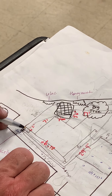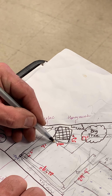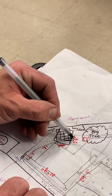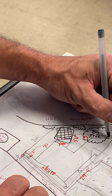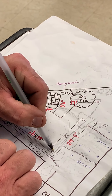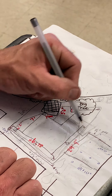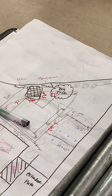Basically it just looks like you'll have one 3/4-inch line coming in. T here coming off and go to that sprinkler head right there. And you'll T off there and go to that sprinkler head. You'll do a 90 coming up here and you'll 45 to that one and then to that sprinkler head. And then there'll be a T here and you'll go to that sprinkler head. And there'll be a T here and you'll go to that sprinkler head. And then up here there'll be a 90 going to that sprinkler head right there.